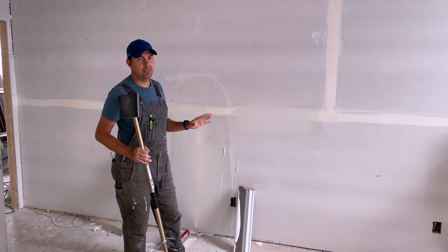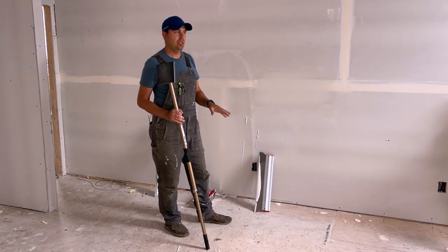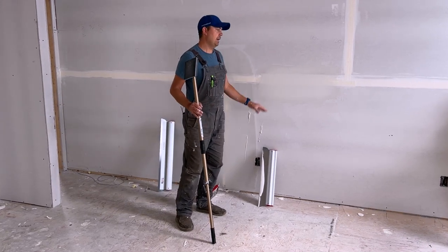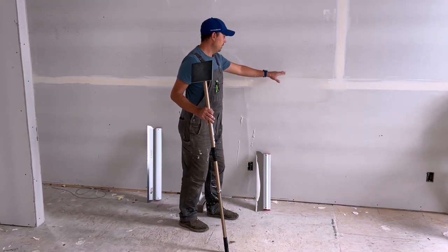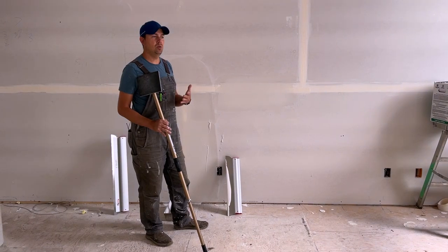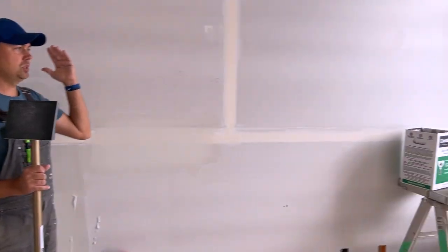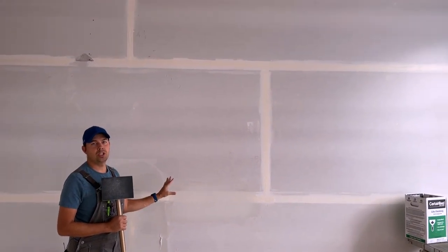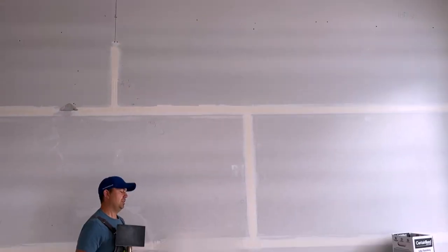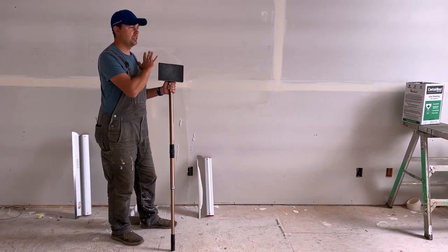This is by far the best way to get flawless joints if you're a beginner or a DIYer — not that professionals don't use these too, they still do. But this is a great way to just not have to hire a professional and do it yourself. These things are awesome — they really do take away a lot of the issues I see going into a homeowner's house where maybe they've done the mudding themselves. Especially somewhere like this with windows where you can see all the light — you really want to make sure you've got perfect joints. It's the light that shows the bad work, and it's really hard to tell sometimes if your work is good until you prime it. So it's all about priming it, and then you'll see where you forgot to sand or where you just have too much mud.